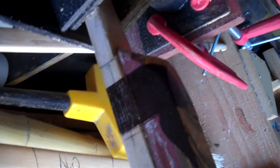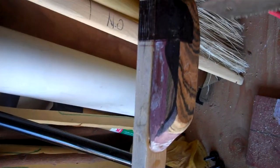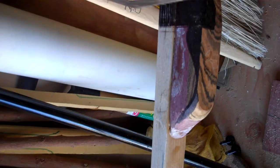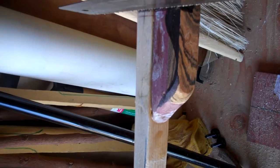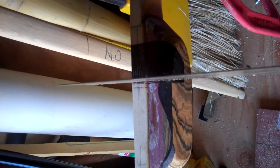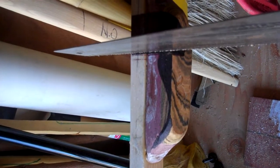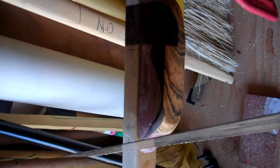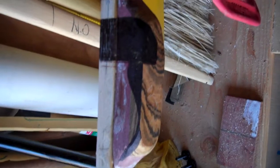I'm going to do the same process at the other end for the other tip overlay. For the shelf, since I don't have power tools, I just take my trusty saw and cut the shelf only. When I get down to the end, I come in with my rasp and rasp out the extra material. The reason I do that is it's really hard to get a nice flat surface with a round rasp. I want to come in and get this nice and flat without accidentally digging deeper into the riser if the rasp gets away from me.